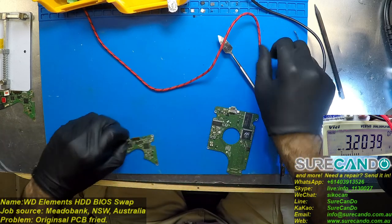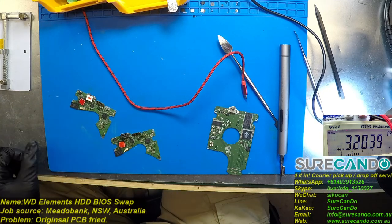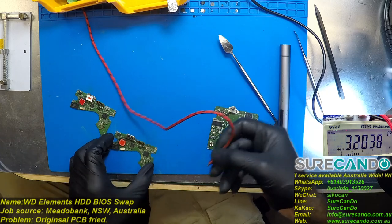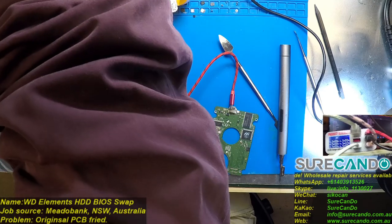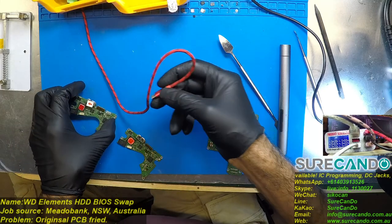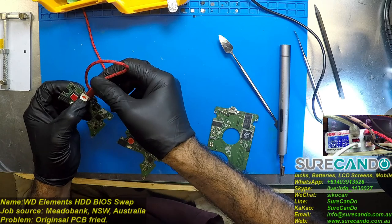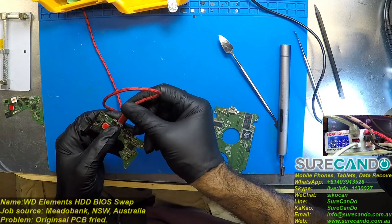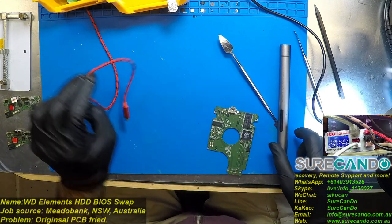So plugging the, let's do a quick test. How can I show you? I think the best way to show you. Okay. All right. So, maybe to show you better. So what we're looking at is the red one, which is the top right. We're going to plug in the good one without a hard drive. It pulls in 0.2. I'm going to now plug in the faulty one, nothing. Okay, so if you get 0.2, you're good.